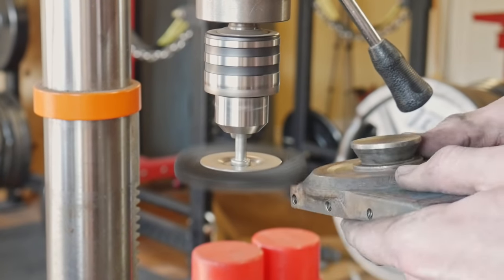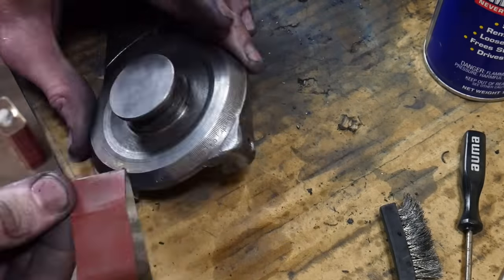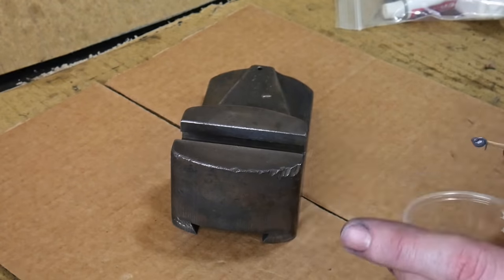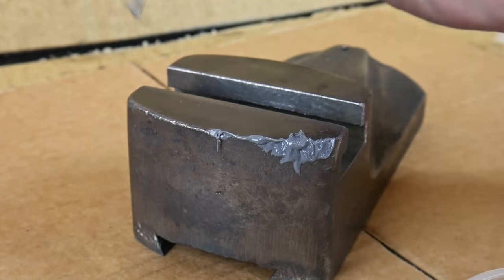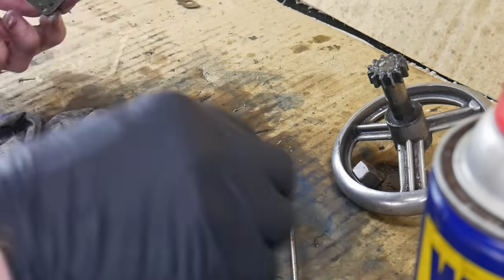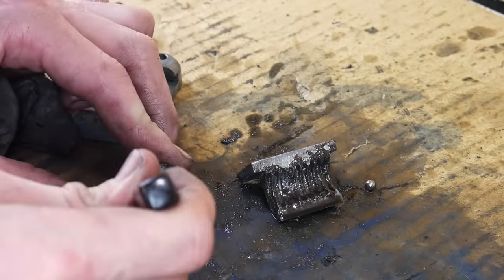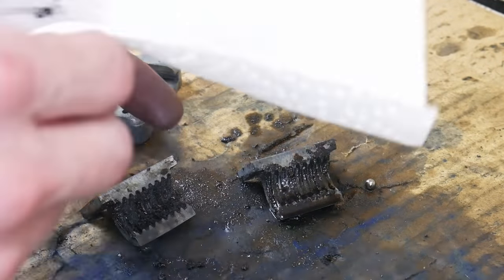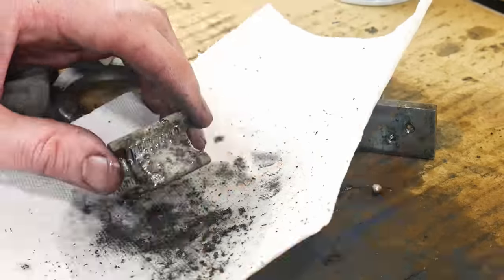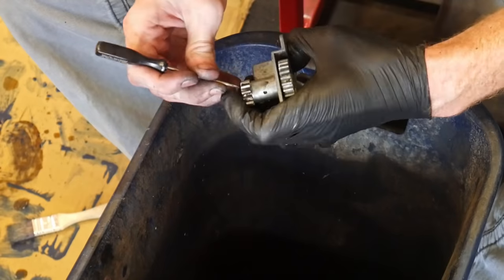This is the wire wheel I set up on my drill press — a cheap 10-inch drill press I used when I was getting back into knife making, and it worked out perfectly. I used it a ton during this process and would highly recommend that setup for a restoration. I noticed there were some chips in my tool post slide, which is extremely common — especially on a lathe used in a school where inexperienced personnel might run the tool post slide into the spinning chuck. As a cosmetic fix, I filled it with a little JB Weld to round out those big chips.